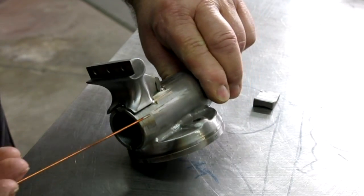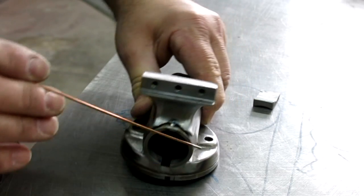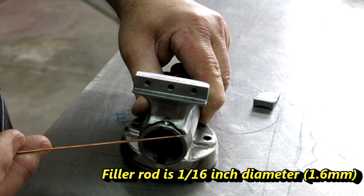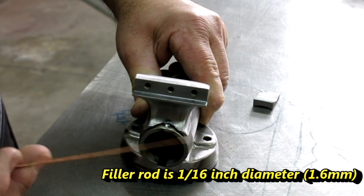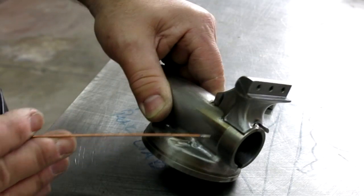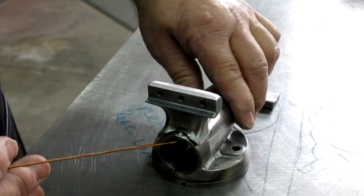Because of this angle here there's a little gap right there — about a sixteenth, same diameter as that — we'll just fill that right in. Although that particular weld we're going to wait until we get a bunch of this other weld in here first so that we don't pull it down.